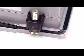A piece of polycarbonate sheeting is shown here to demonstrate proper use of the gasket and mounting clamps. Pay particular attention to the cutout dimensions for the specific model. An accurate cutout ensures a proper gasket seal.